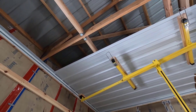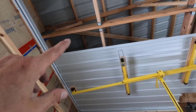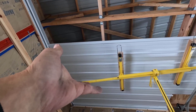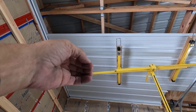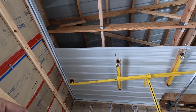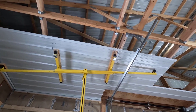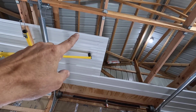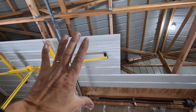I got one panel in. For the most part I'm just taking a nail — after I get a line, I push the panel up as tight as I can to the joist, then tap the nail with a hammer to get a starting hole, and shoot a screw up into it. Looking pretty good. I missed the joist a few times with the stapler, but that's not going to matter at all — the next panel covers that completely.